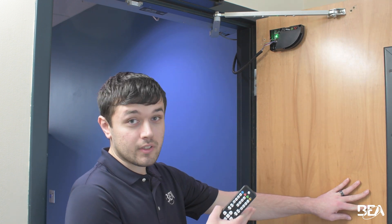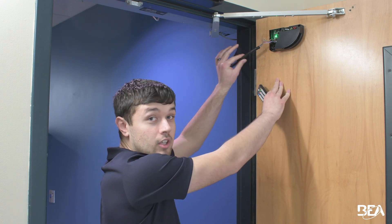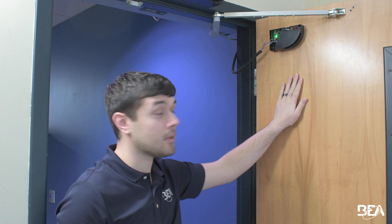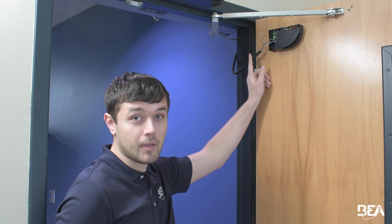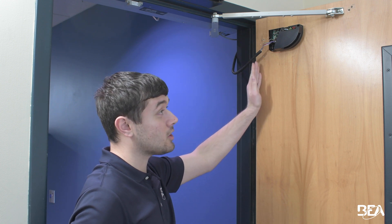If there's nothing in the pinch zone, you can see that if your primary sensor harness is on the stall side of your door and not the approach — because it doesn't matter which side you choose to be the primary sensor — this harness may be in the pinch zone, and that may be what's causing the green LED on the stall side of the door.